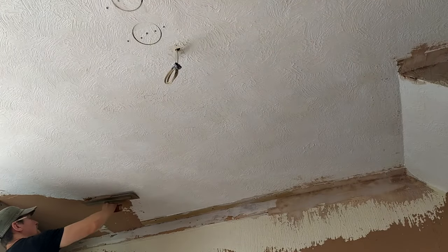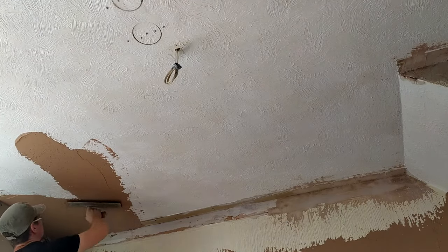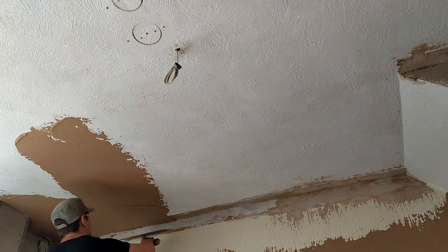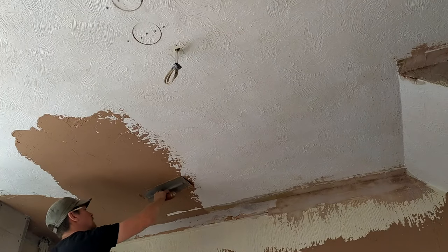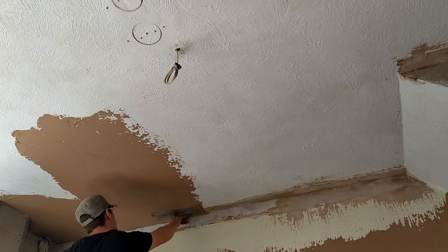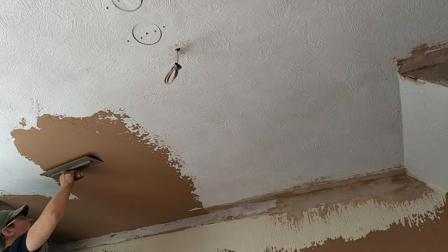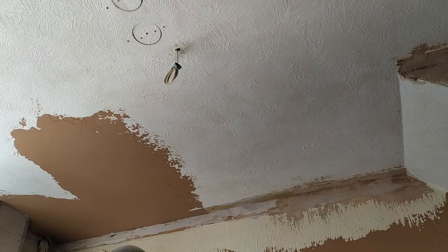So that's it prepped. Now we wait for the second coat of PVA to dry. The second coat's been applied onto the ceiling. We've got rid of any high spots of the Artex and scraped that back. Now we've got free reign to start applying plaster. You want your plaster not too wet — definitely not too runny — so when you mix it, mix it with a bit of thickness. If you're not sure about how to mix plaster or any stages of plastering, wait till the end of the video and I'll give you an opportunity to learn the full process.